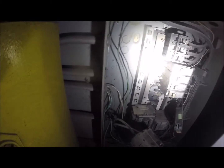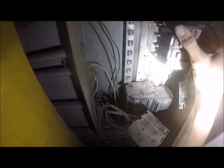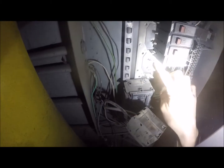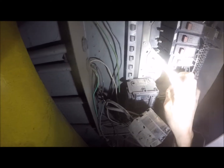You know, this is a trip. This is a three-phase panel, right? Where's the third-phase lug? I only see two phases. That's one phase. Oh, I got one running right down the middle. That's what it is. That one's segregated by everything. So, we're gonna have to be really careful with that. Yeah, see, I don't like that, but this bar right here, and I'm touching it, it's dead. This whole panel's off right now.